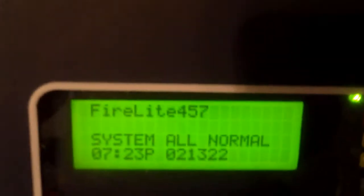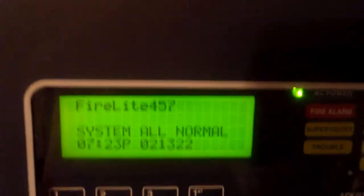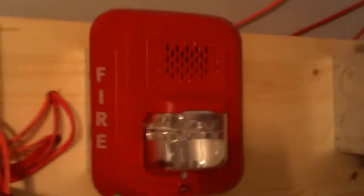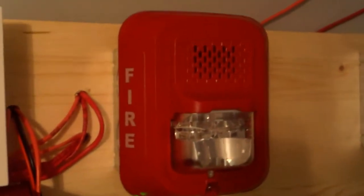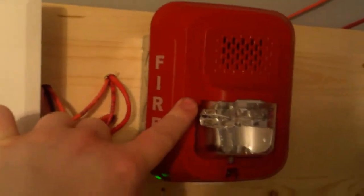This system test was requested by Fire Alarm Discovery and I have a little expansion out in the hallway that I'm gonna show y'all. But for now, coming up here, NAC1 — he requested the System Sensor L-series, set on code 3 horn low volume and the strobe.